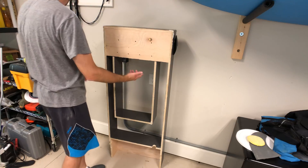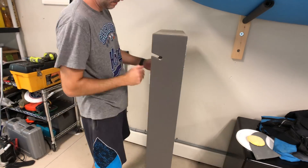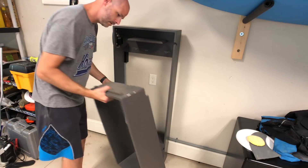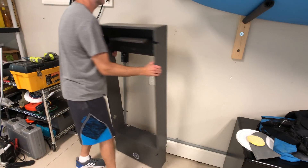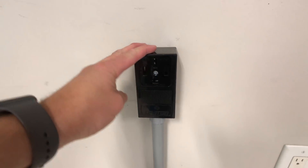These four screws hold in this shelf. I'm going to set this aside for right now. And this is the electrical line coming up — it does a 90 degree angle and goes right into this. Before you do any electrical work, turn off the breaker and then test it again. Once again, if you're not comfortable doing this, don't do it. You should be 100% comfortable doing this.